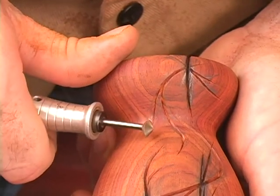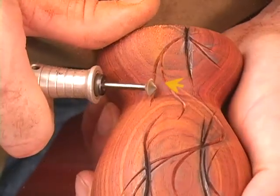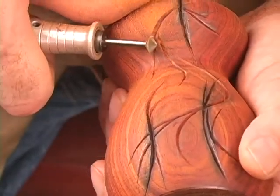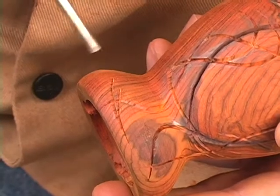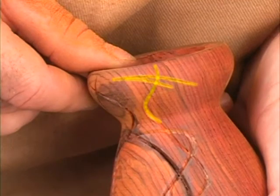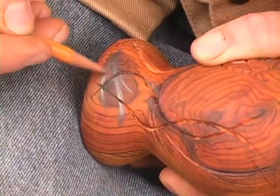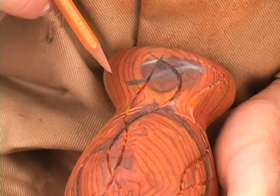By incorporating these techniques, I'm going to broaden out this curve by pulling the cutter to the left and making the path a little bit wider. This creates a fuller curve with a much nicer transition from thick to thin. I usually don't like to leave individually carved lines running off the form — I much prefer to see an intersecting line to stop the eye from flowing off the form. While these two lines intersect, they still tend to carry your eye off the form, so I've sketched in some pencil lines to prevent that. This should also help to visually balance the adjacent intersecting line.